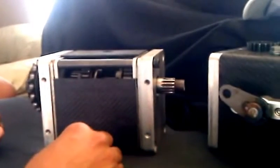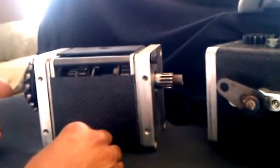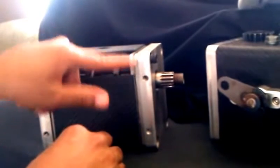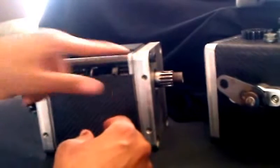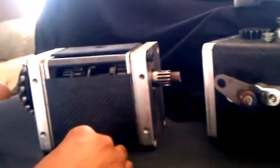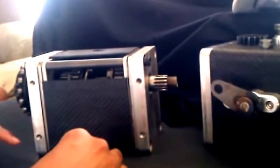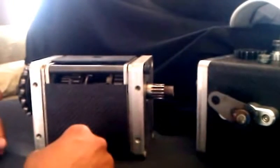It's cheaper to make than the metal or aluminum counterpart, because I don't have to worry about it getting CNC built or manually bent to worry about the radius right there. We have a form with this profile that we lay it on and vacuum seal, and we just make the whole profile. Very lightweight, easy to make, very affordable. We have this 356 aluminum cast right here, cast into a formation of the bearing housing plates, and we just do the finish machine work on that.